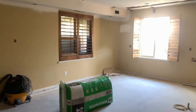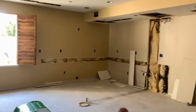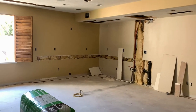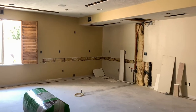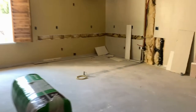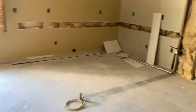Starting off in this area, this is the area that was previously finished. We're going to be installing a full kitchen here — 11 by 12 — with a dishwasher, fridge, stove, microwave above the stove, and an island. We've got some quartz countertops coming and pendant lighting above the island. The island is all set up with conduit and the electrical line. We cut out a strip of concrete, put the conduit and wire in, and poured that back, so that's ready.